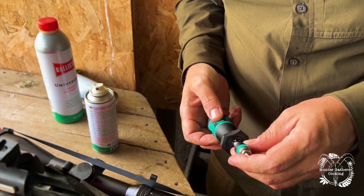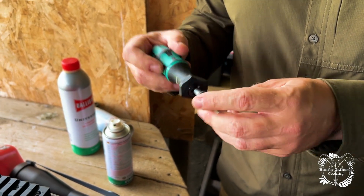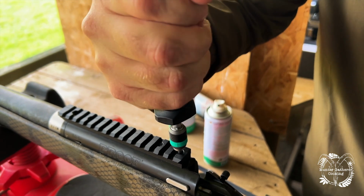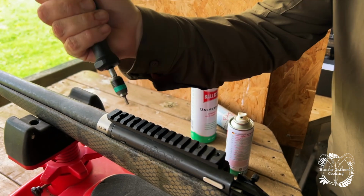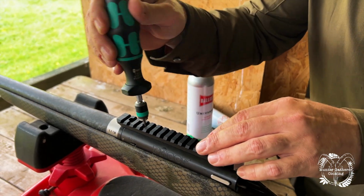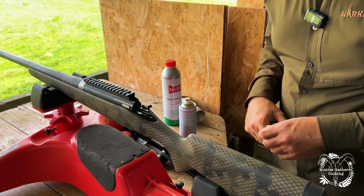That looks very nerdy, gadgety. Yeah, nice. I mean, these are worth getting. This is a torque screwdriver, so I can set the amount of torque that it puts on the screw, just so that I know I'm doing it up tight enough, but I'm not over tightening it. So you can hear it just cam over there when it's tight. So you just cannot over tighten that? No. So who makes that one? This is from Wiha. But I'm sure there's, again, just off of Amazon. They're not cheap, but if you do a lot of this sort of thing, they're worth doing. So those are nice and tight, and you can also now ensure they're all the same torque setting.